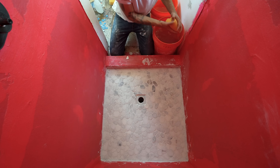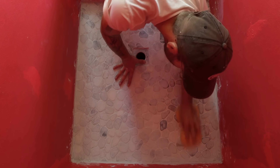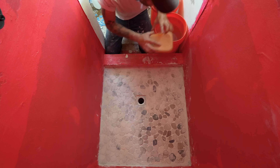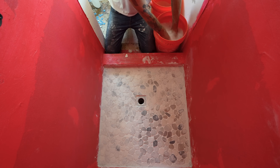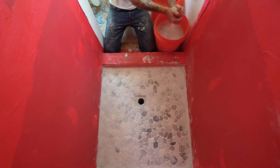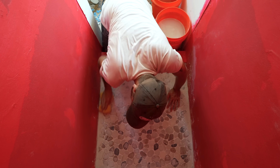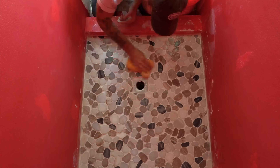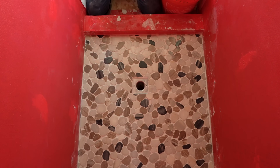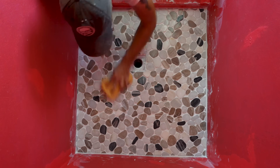Now I'll use a wet sponge to clean the grout off the surface of the tiles. I'll wipe in a circular motion — just don't press down too hard. I'll wash my sponge in one bucket which will be my dirty water, and after I wring it out I'll load it up with clean water — that helps me go through less water overall. Cleaning grout is the definition of rinse and repeat; you just want to do a gradual cleaning and with each pass it'll get cleaner and look better. For the tile I'm using, I want a little bit of a recess in my grout lines, but you don't necessarily have to do that.